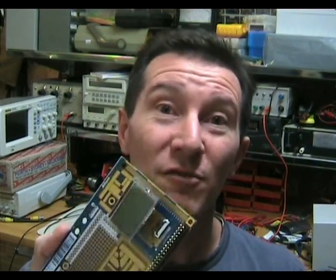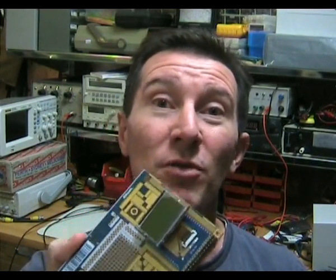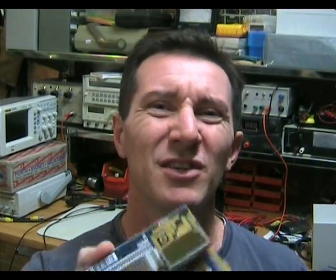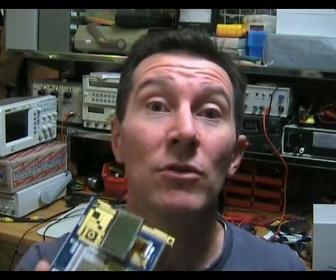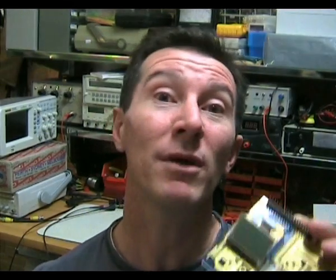Now, even if I did have my logic analyzer with me, probing 16 channels is just a pain in the butt, and you don't really want that hassle. So next time, if you have a choice between serial or parallel mode, and you need to do your development fast with the least amount of hassles, I'd recommend using serial mode.